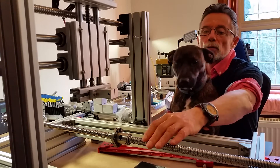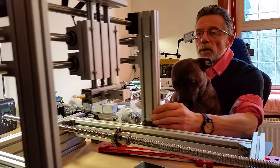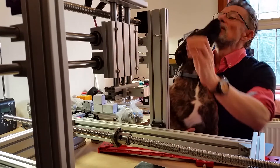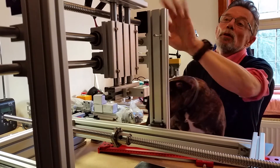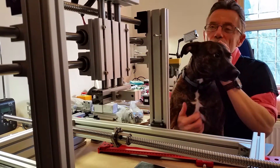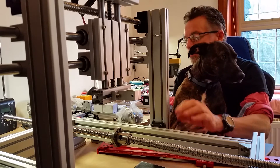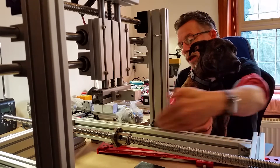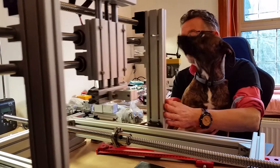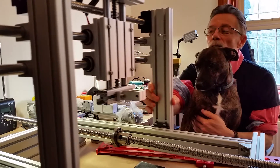There are some expensive parts you have to buy, like ball screws — a very highly accurate screw that will move this backwards and forwards. There's one here, temporarily placed so I can measure it. It will rotate and that rotation drives this in a linear fashion, transferring rotational to linear motion. The most expensive parts are the rails on the Y axis here. This is quite a heavy gantry, so you need something that lets you go backwards and forwards easily and carry quite a lot of weight.